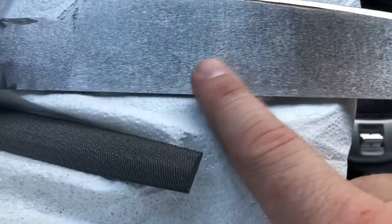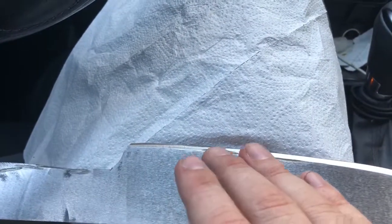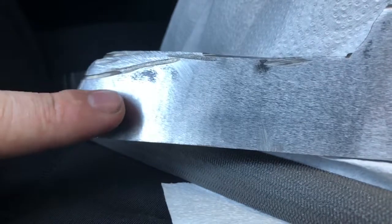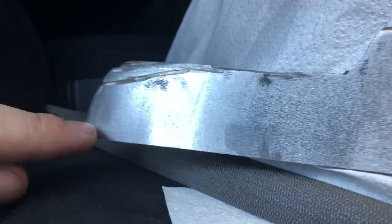There's a reason why it looks so nice here: I took my table grinder and ground it down. Well, you grind in the bevels. These are the bevels right here. You grind them in pretty deep first. Then you grind it flat. That'll reduce the amount of bevel to it. But also, this part right here I cut in on accident. Had a little runaway angle grinding incident there where I was going this way and it went. So that's where we're at.